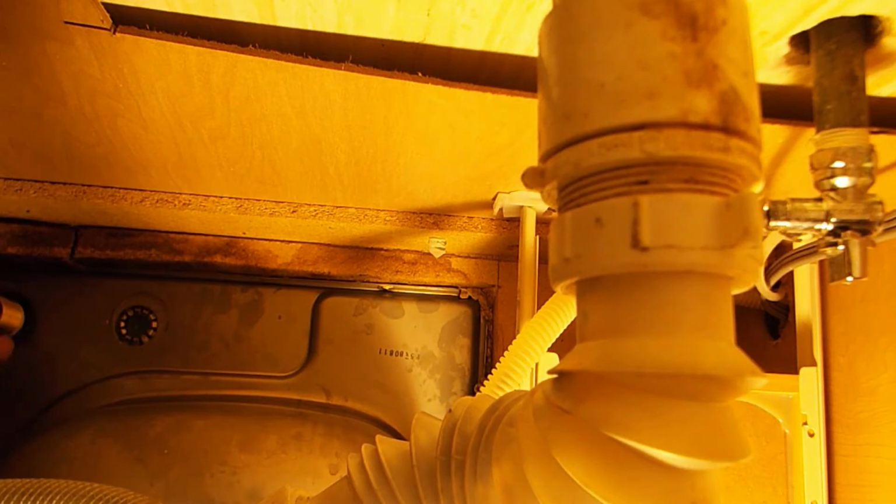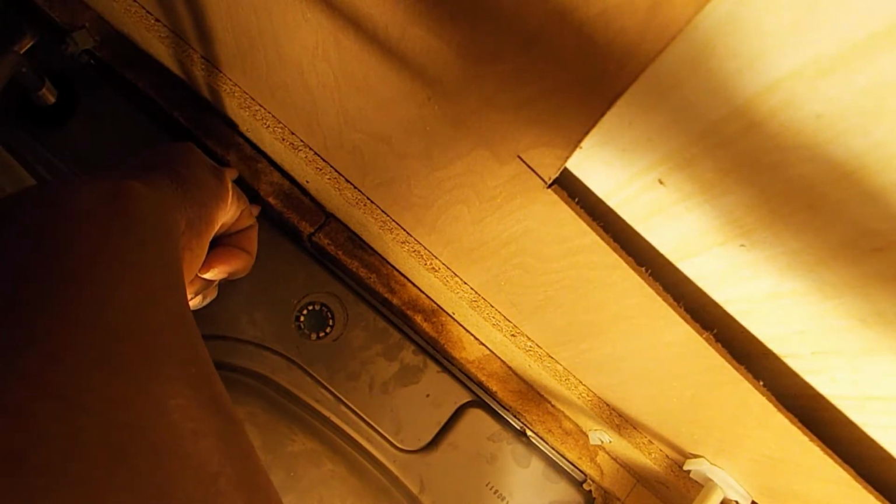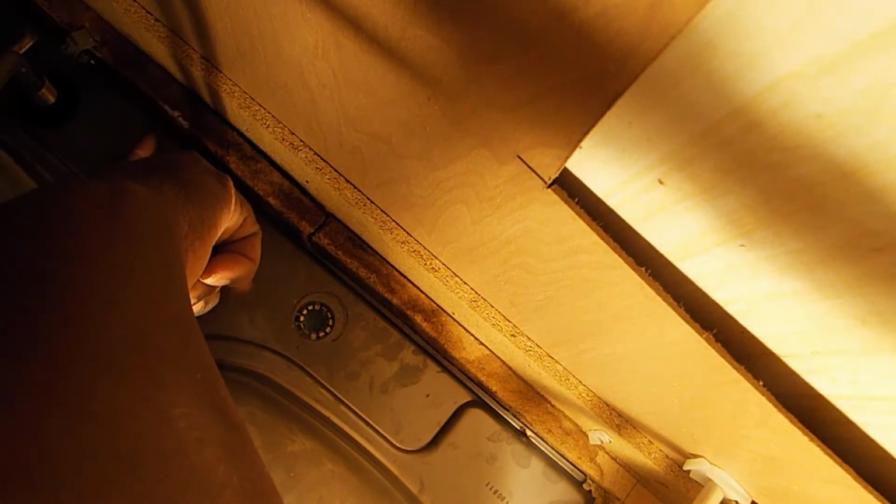I'm going to push the rubber up. I don't know if I've got the camera focused on what I'm doing here. I hope I do. Okay. Pulled the washer up, and now I'm just going to tighten it with my hand, and then I'll get the pliers and finish it off. Only thing about it when I do it, I always have a leak. Lord, please don't let me have a leak this time. This is a very heavy faucet, so I have to tighten this really tight. I'm going to tighten as much as I can with my hand. Now the rest, we'll use the large pliers.